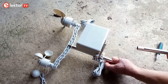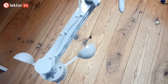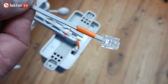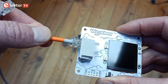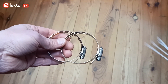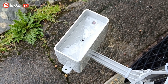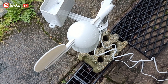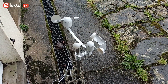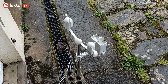Even though everything is secured with nuts, bolts and screws, the complete assembly remains a bit wiggly. The second metal tube slides into the first but is not secured by anything — I wouldn't trust it in a storm. The cable of the wind speed sensor connects to the bottom of the wind direction sensor, so only two cables run down the mast. I recommend clearly labeling them because the Weather Hat is picky about which sensor connects to which socket, and once mounted on a pole it is hard to see. The assembly can be attached to a pole with the two gear clamps and four long tie wraps included in the kit. Running the cables through a plastic conduit to protect them against the sun might be a good idea.